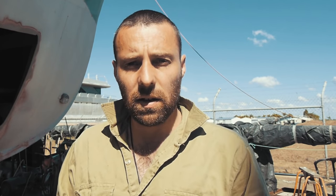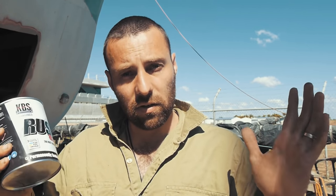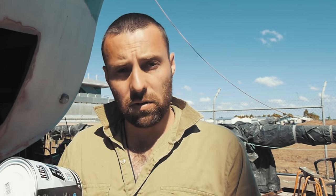I'm going to walk you through the process of putting this paint on. It's fairly particular to get it right, but once it's on it's a rock-solid paint. It's got flexibility — as the boat bashes around, jumps off waves, hits ice, and the hull flexes, it's designed to allow for that without breaking down and causing a failure where the oil can touch the steel. We looked at quite a few different options and this was by far and away the one with the best qualities for what we're looking for.